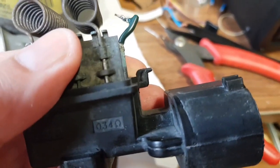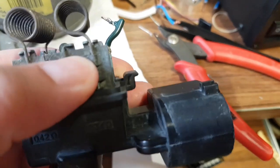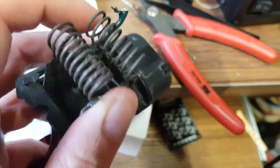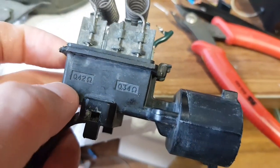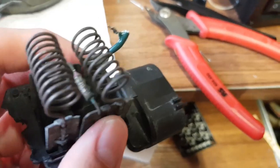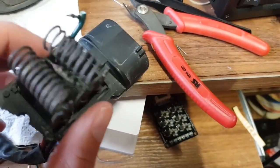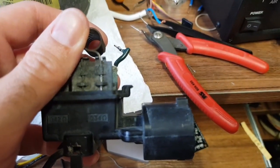First I've got to remove the old coil. This is very corroded so I've got to clean up these contacts and remove them — they're just pressed in. Then I'll move the leg, press in there, and get some new nichrome wire, twiddle it around and stick it in. The resistance is written on here helpfully: 0.42 ohm and 0.34 ohm.